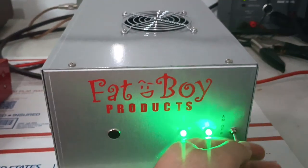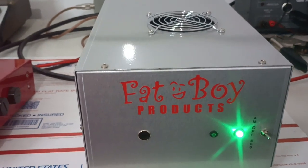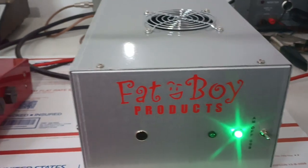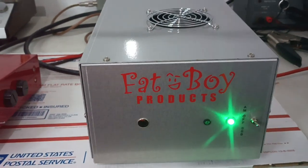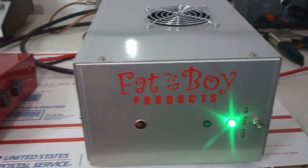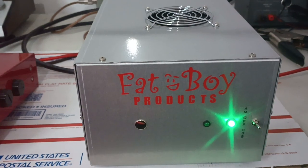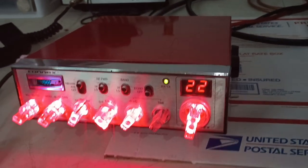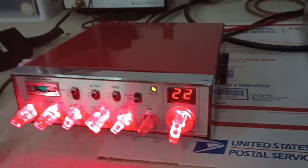You can hear that slight delay, just long enough for the sideband operation. And then on AM, there's no delay. So just how we would intend it to work. Now these 454s, I generally recommend people put anywhere from 60 to 70 watts PEP. But by the power output this one's doing, I honestly think 50 watts PEP or swing is plenty.